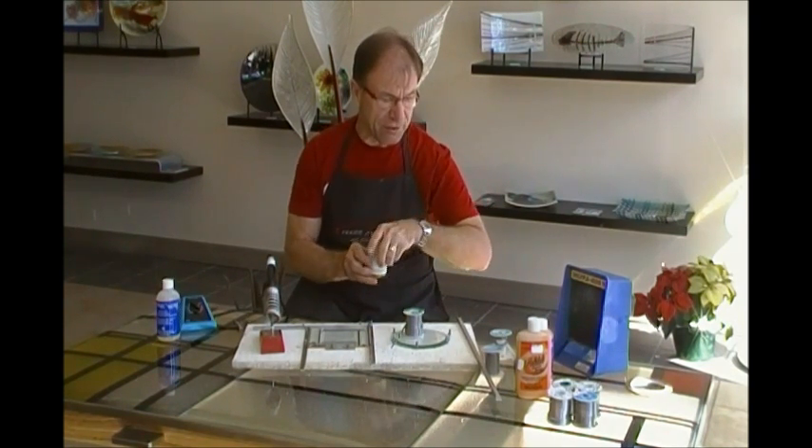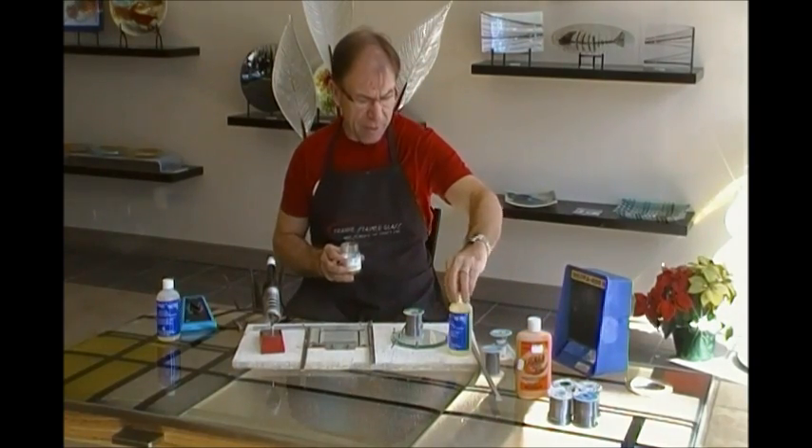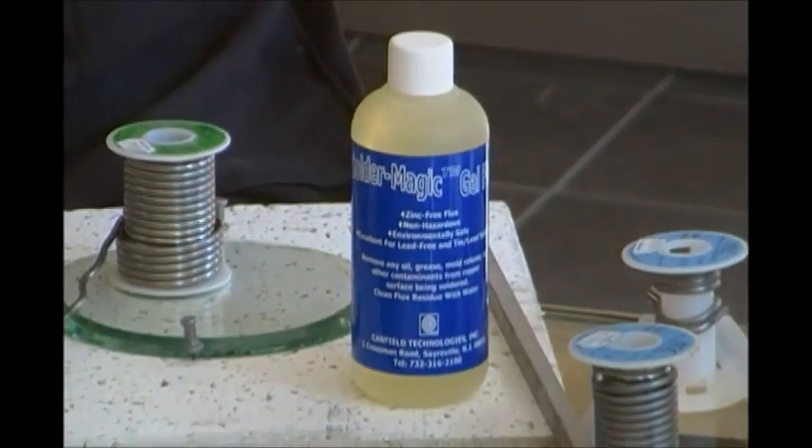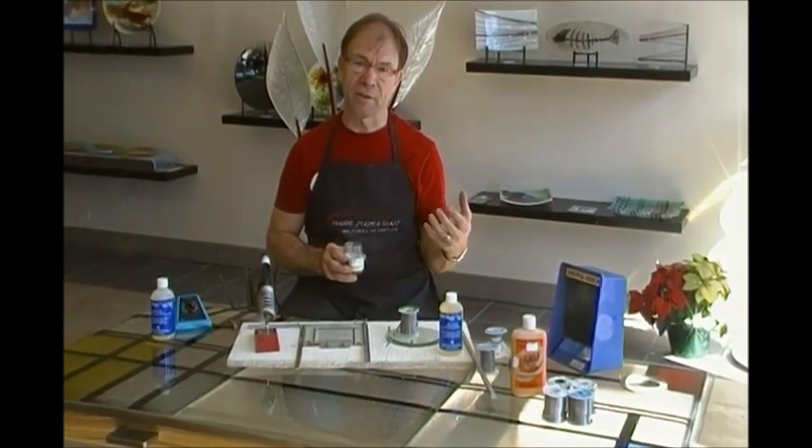When you're using flux, my favorite flux at the moment is the Solder Magic Flux. It's a gel flux — a little thicker than some of the liquid fluxes — but it's a non-acid flux. Zinc chloride is the most activation you'll find in most fluxes. If you look, there's always a skull and crossbones, and that doesn't make me feel like something I would like to use. Although the non-acid fluxes aren't as active and don't move or act as quickly, and don't sometimes float quite as nicely, I find with practice you can get used to them, and they're much better for the environment and for your own health. I personally would highly recommend using something that is a non-acid flux.